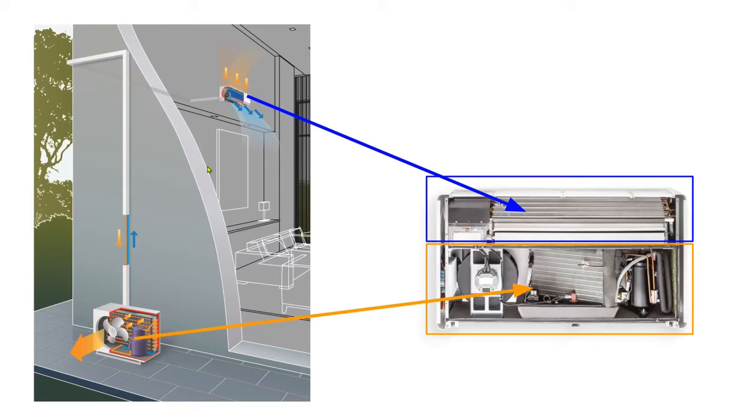Will your product in the future be able to handle sub-zero temperatures? Absolutely. We can actually handle it right now. The truth is the efficiency and the performance with the R32, with the propane, and with the R410A are pretty similar. Because our unit's so small, the difference is not that great. It may be a difference of maybe 3-4% increase in performance and efficiency, but it's not a great number.